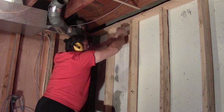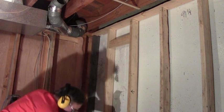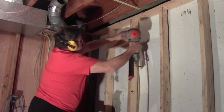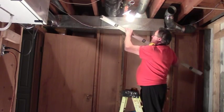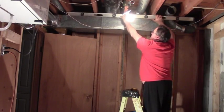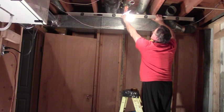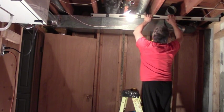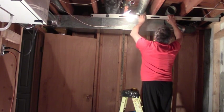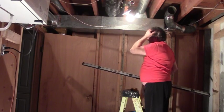So you just measure your piece, put it in there nice and tight, make sure it's flush, and then just nail it in. Now we're not done. The next thing we need to do is build our frame to go across the ceiling. You just want to grab a straight edge and make sure the bottom of your joists are all level — they are nice and level. If you grab a six foot level, it makes life a whole lot easier, because you can check everything as you go along. And that is going to be working out hunky dory.